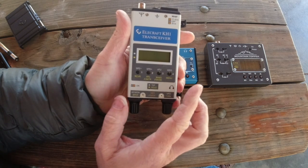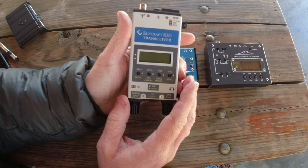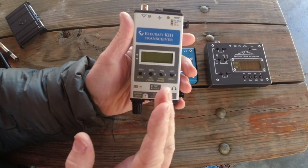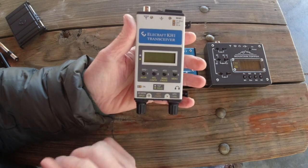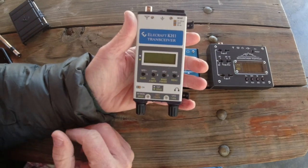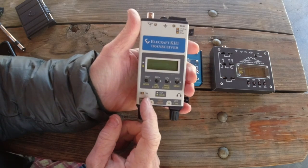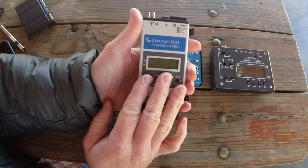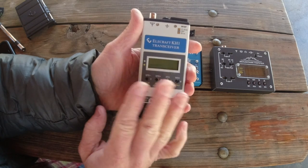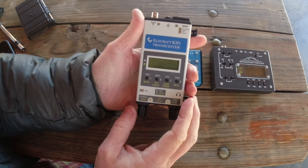that can also receive single sideband, and it does have general coverage receive, which means that you can hear outside of the ham bands. You can receive outside of the ham bands, I think, from about 6.7 megahertz up to something like 22 megahertz. But basically, it covers quite a bit of the shortwave broadcast band. So you can do shortwave broadcast listening by widening the filter in the SSB reception configuration. Then you zero beat the broadcaster and you can listen to it, which is kind of cool.